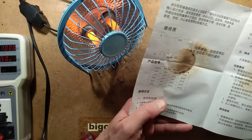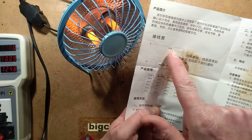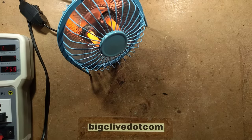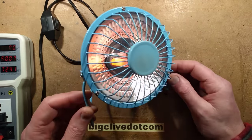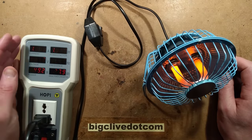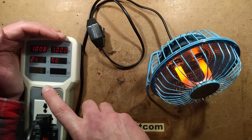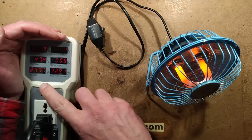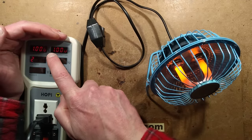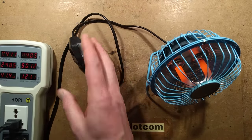Notable things about the instructions, which are all in Chinese: there's a schematic for helpful troubleshooting — the switch goes live, switch, heater, neutral. This is available in a few different ratings; this was the smallest, described as 4-inch, and supposedly between 200 and 250 watts — that's spot on. It's drawing just over an amp on a 247-volt supply: 249 watts, so just barely short of 250. The power factor is, of course, for a completely resistive load — it's unity, perfect power factor. It also comes with a little inline switch.